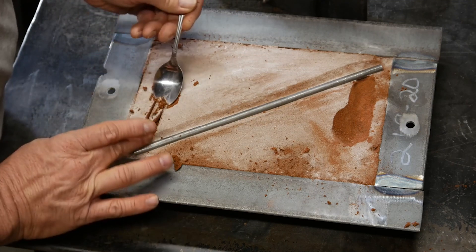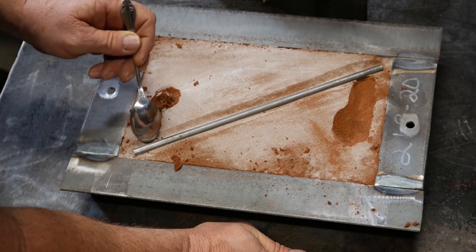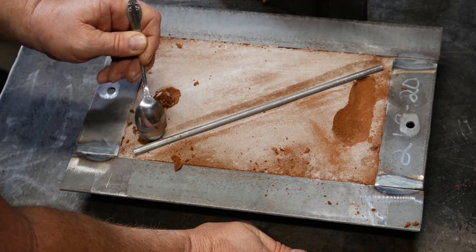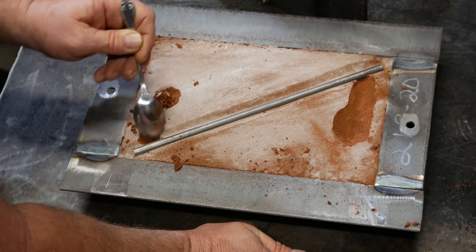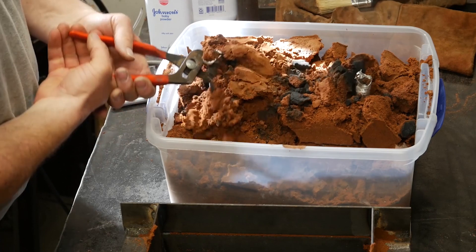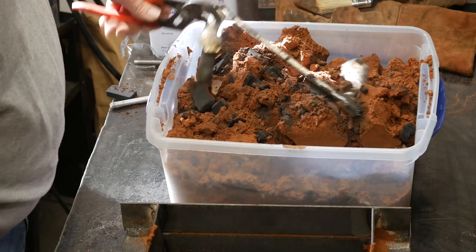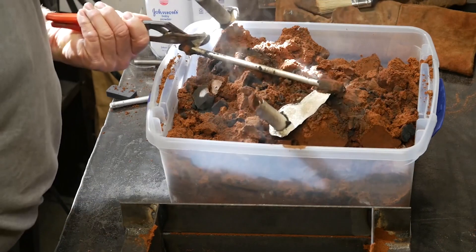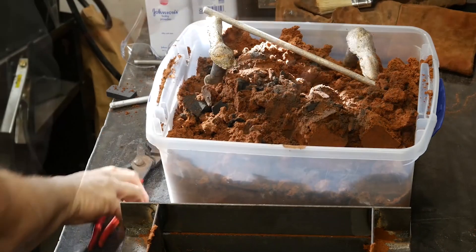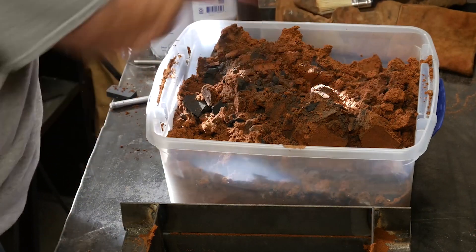The gate from the part to my vent is huge — just something I'm going to have to deal with. I even cut a basin there too. And here comes the part out of the sand. You can see there are just huge things I've got to cut off the end of that rod to make it useful. So, not a great way of doing it.